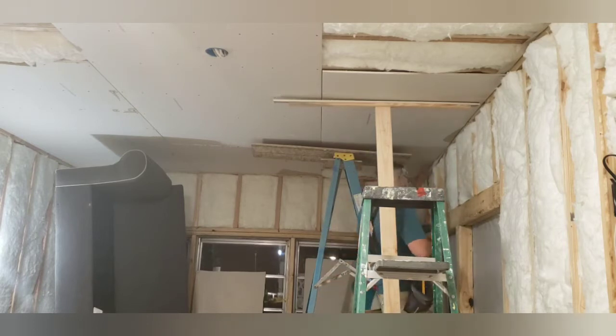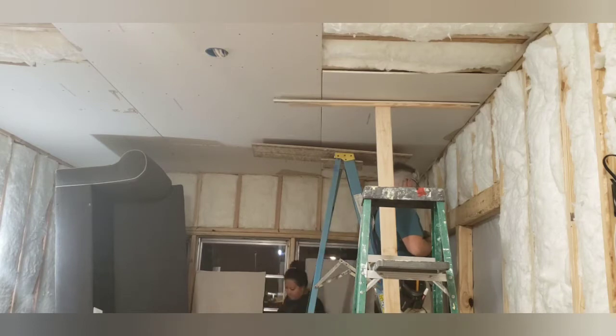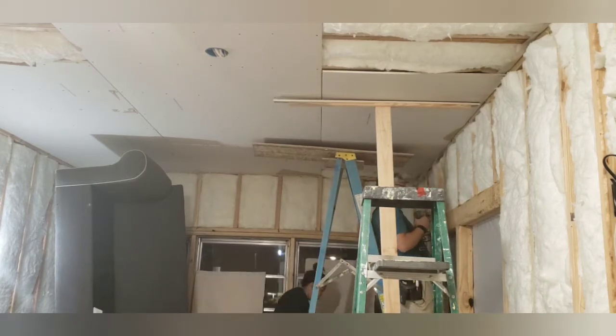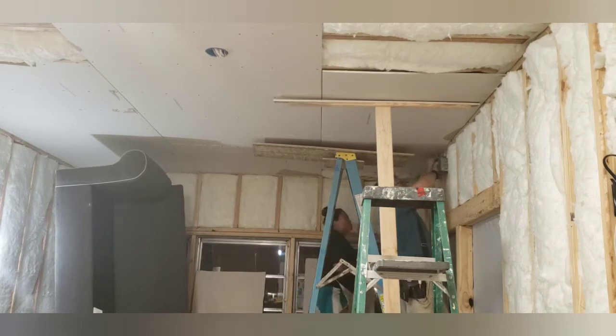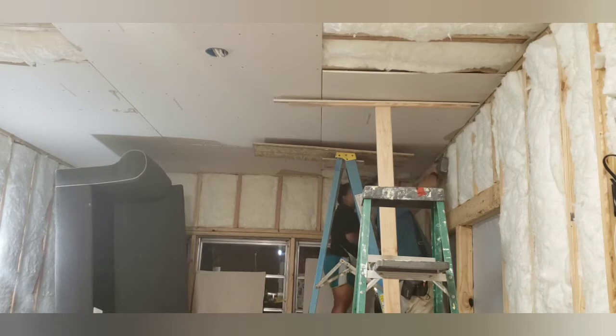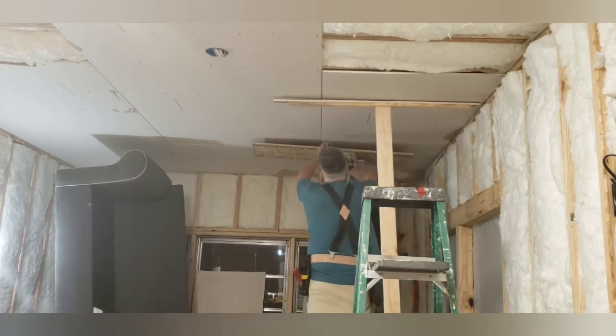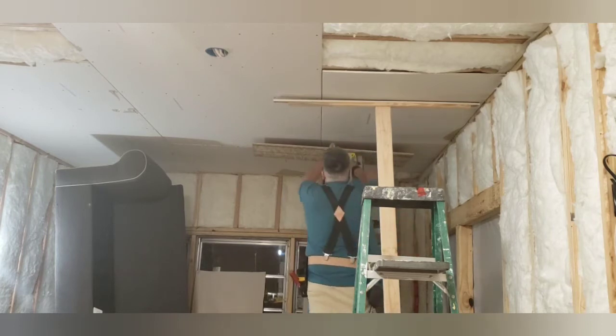We went back to what we originally did with the bedrooms — we made a cross out of two pieces of wood, and you can see that's what's holding up the drywall. On the longer ladder with the yellow top, we had actually nailed a plywood piece of wood to it, and then we would shimmy it up to make it tight so it would hold the other side of the drywall. This worked out well for us — we should have done that in the beginning.